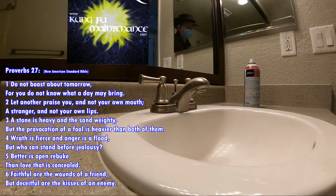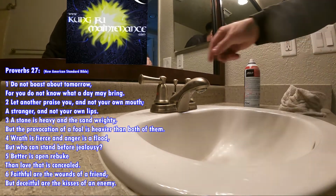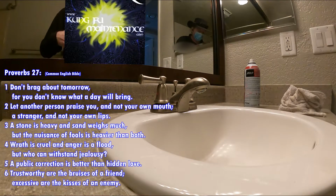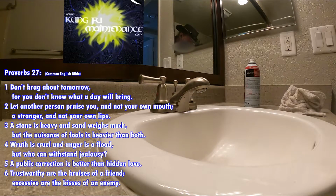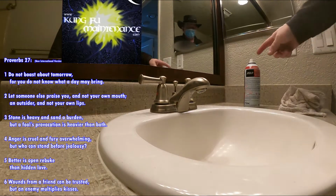But again, you might want to put a bucket or a rag or just something to catch anything that might drip down there on your stuff. And now the squeak is worked out and we're good to go. Again, silicone spray is ideal. Other things stay wet and then they collect hair and dust, where the silicone spray will dry and maintain that lubricant quality.